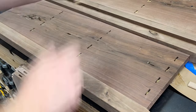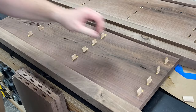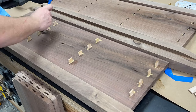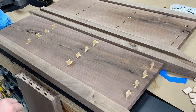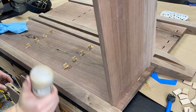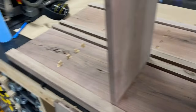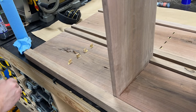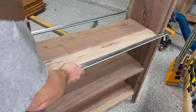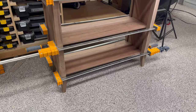This is only my third time using a Domino for a project like this — I've only had it about four months or so — but there's something oddly satisfying about seeing a project come together like this. As you're doing the glue-up, all the different pieces just fit in perfectly and align properly; it's really satisfying to watch that come together. Once everything was assembled, I used some extended parallel clamps to apply pressure at each one of the shelves until the glue had a chance to dry.